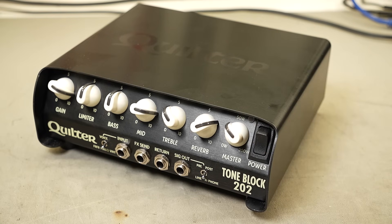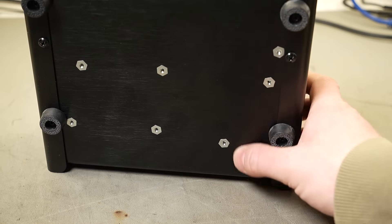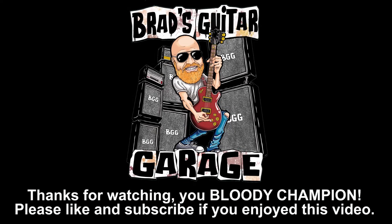It is quite a cute little chassis. I wonder if the entire preamp is on the front board — if so, we could just drop a nice power board in there. Usually with designs like Mark Bass and DV Mark stuff, the whole preamp is contained on the front PCB and the main board is just the power supply and output stage. You can sometimes drill new support holes to suit another brand's board, so that could be another option if we get crickets from Quilter.